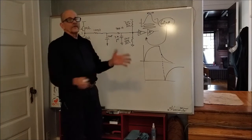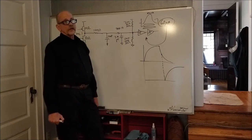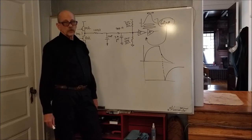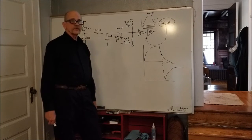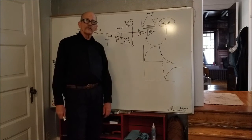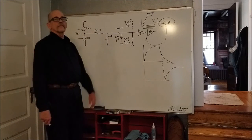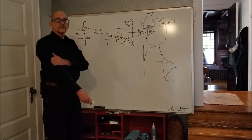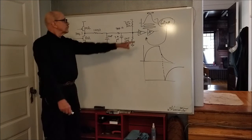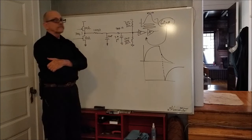They brag about what they're doing when the chip is sitting there all by itself doing nothing of interest to anybody. We'll use the SPI one because SPI is more power efficient than is I2C in general, especially if the people have pull-up resistors on their drivers and drive them open collector or open drain rather than driving them push-pull. So that is the outcome of this little experiment. It'll warrant a footnote in that note too. But anybody that was hoping for us to be right about this, nah, we're wrong. That's too costly. You can't run slow-moving inputs and get away with it.